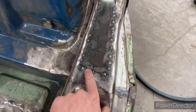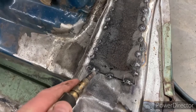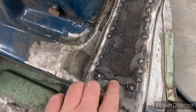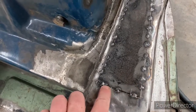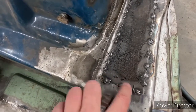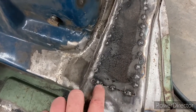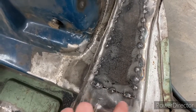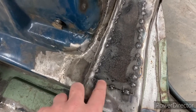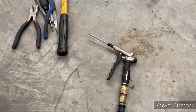After each tack, get some compressed air and get that heat out of there right away. When we got to the ends with that larger gap, I just held the welder away and dropped the metal into the gap rather than getting close — if you're too close it's going to blow out on you. Once you get good tacks established you can work back off those, just hold it back a ways and drop the metal in so it doesn't blow the hole bigger.